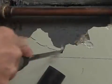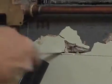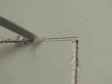Using a keyhole saw, cut from the inside of the circle to the edge and follow your way along the line. Cutting plaster or wallboard creates a lot of plaster dust, so vacuum the dust as you cut. You'll be glad you did. Carefully square the corners of the hole using a drywall saw.